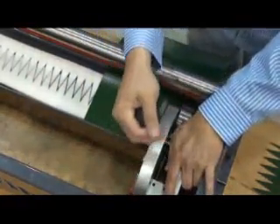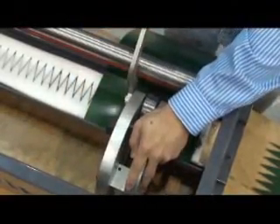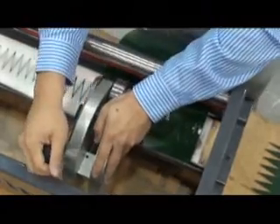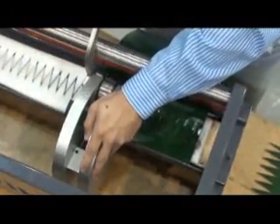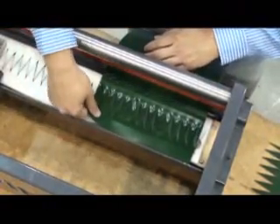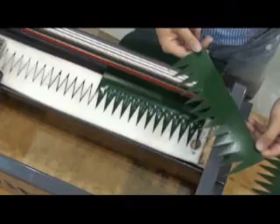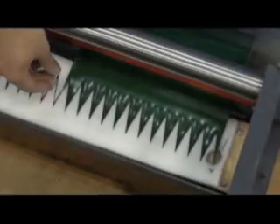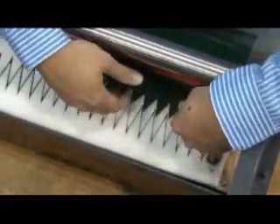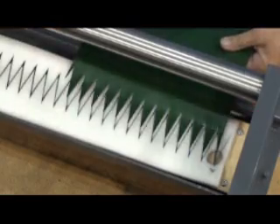Punch the fingers across the entire width of the belt. Remove the punch fingers, raise the remaining fingers, and rotate the handle to remove the belt.